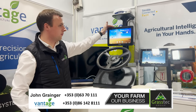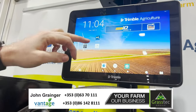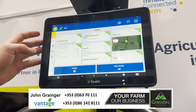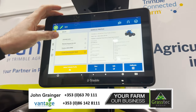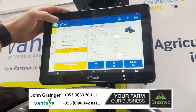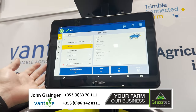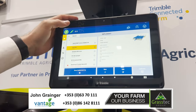When we power on the display we have our App Store where we can download different apps, and our Universal Terminal where we can operate and implement through. Clicking into Precision IQ brings us into our home screen. The system is currently on CenterPoint VRS. Our vehicle profile is saved here so if we're swapping this screen between tractors, we can save different tractor profiles and all the measurements are shown here. Similarly, we can save our different implements — you only have to input the measurements once. This makes it very simple if you're swapping from a fertiliser spreader to a sprayer; you just click on which implement is on the tractor.